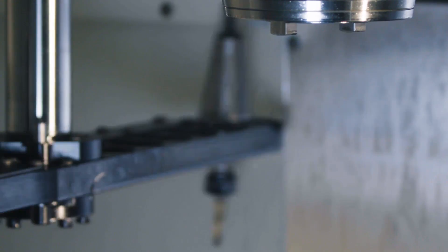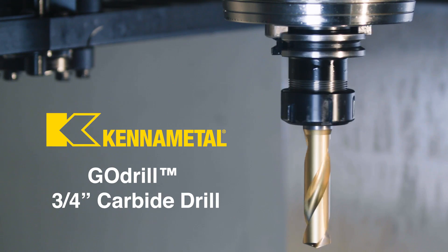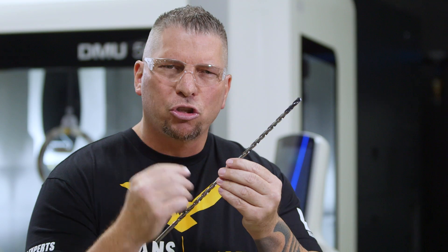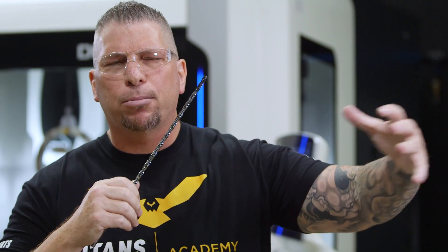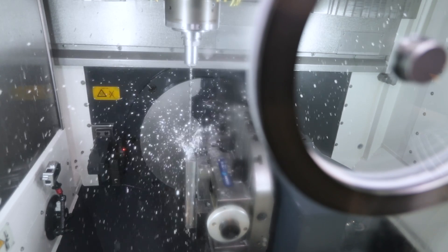The platform is the SGL drill. You already know the SGL drill is a crazy drill for stainless. I talk about the GO drill all the time — I'm actually drilling Inconel, titanium, Monel, and Hastelloy with the GO drill because it's a standard tool, you can drill anything, and it's cost effective. The SGL costs about twice as much, but automotive companies drilling a million holes use it because you can drill twice as fast in stainless and get a million more holes than with the GO drill. The increased productivity means the drill pays for itself quickly.